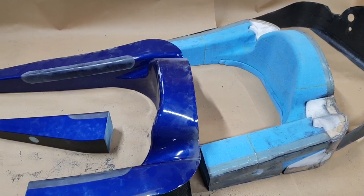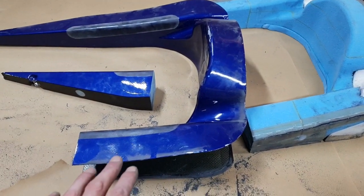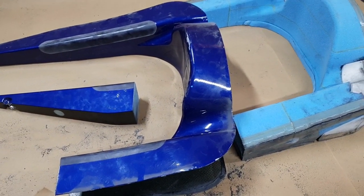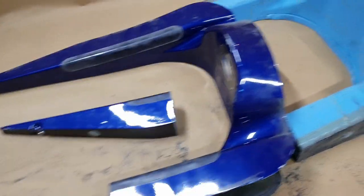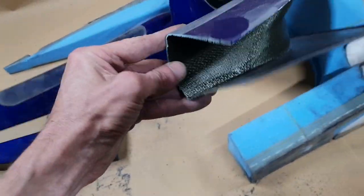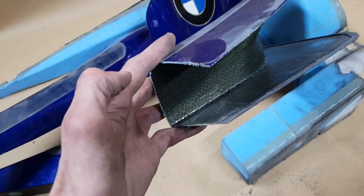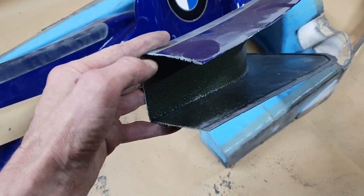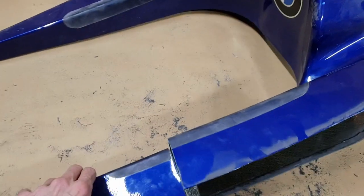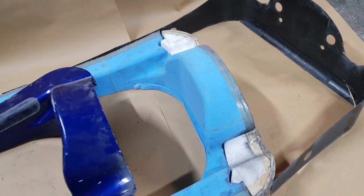Okay, so with the parts separated, you can now see a fair bit going on. So let's just ignore what's over there for the moment, and I'll talk you through the Kevlar carbon first skinning, or the first part that was made or put on the bench in order to assemble the entire part. So this is all the thin part here. So you can see that it's very flexible, really flexible here and here, as mentioned. And the bond line then would be here and here, 90-degree bond line of the thicker carbon fiber to bond them all together. Now this part obviously would be made like that. This leg on here too. The foam then inserted, and the outer part, which is there, bonded in.